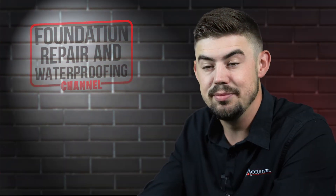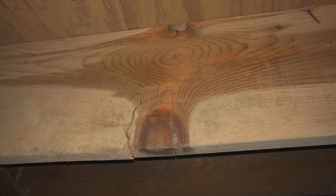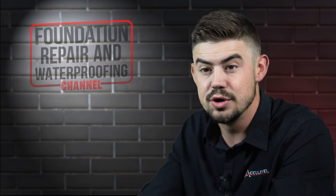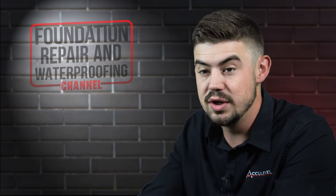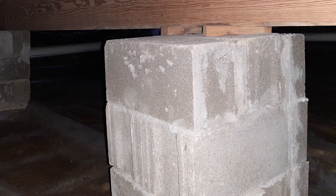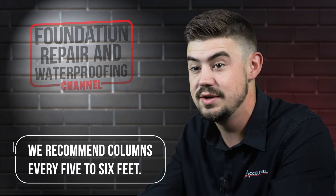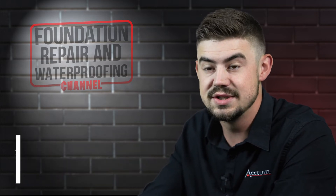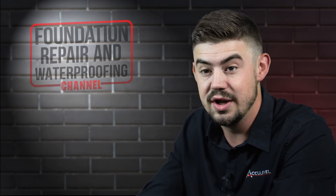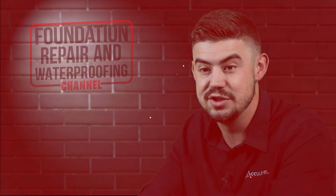When we see a damaged main beam, it's usually a couple of different reasons. Moisture or water intrusion inside your basement or crawlspace starts to weaken that wood and allows it to either completely rot out or start to sag between the columns. The other reason is that the columns are not the right size or they're spaced out too far. We recommend having columns every five to six feet. Most homes have columns every 10 to 12 feet, and so this can allow that beam to start to sag between those columns, or if the columns aren't adequate enough, they won't support that beam and you'll start seeing sagging floors inside your home.